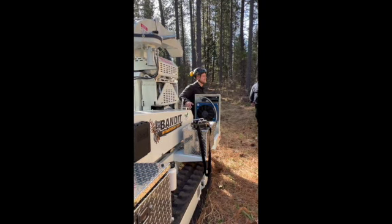So let's go ahead. We'll jump to the belt. Again, we kind of touched on it. Your belt is what is actually transferring the power from your 120 horse engine to that drum. If this belt is out of adjustment, you're not getting your proper horsepower to that drum. You're going to increase your clogging chances. The machine's really just not going to perform like it needs to.